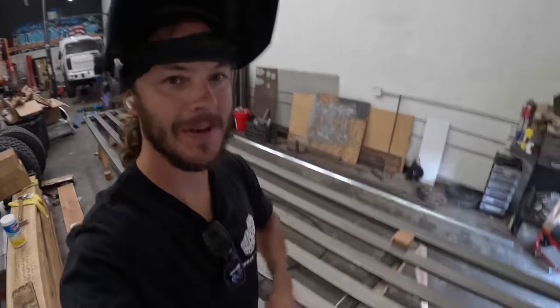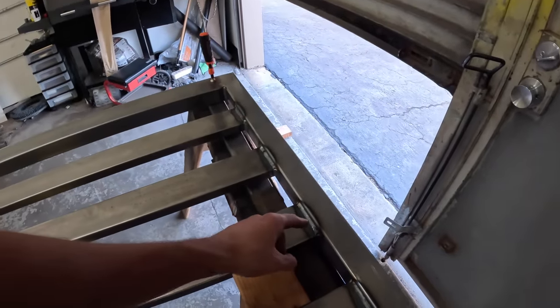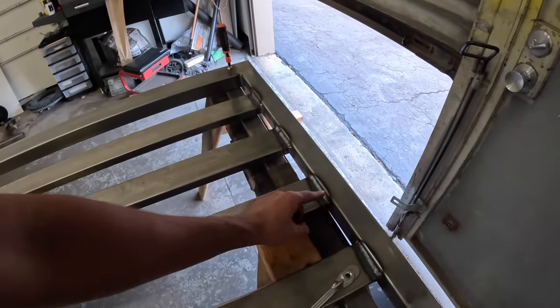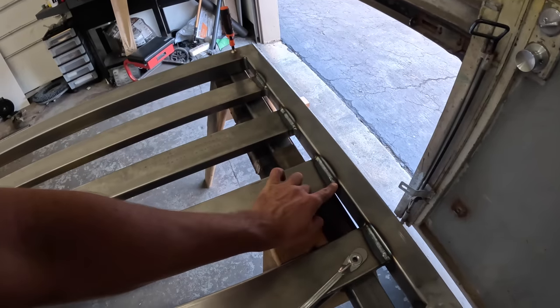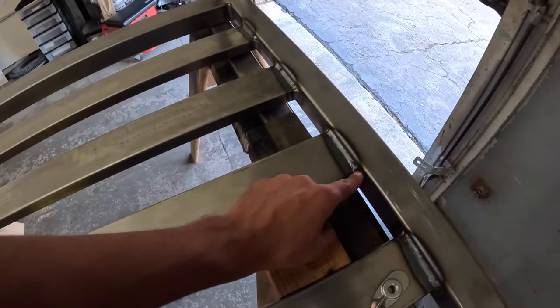Aside from flipping it over, we've got all of the horizontals in. The welds are decent — there are a couple little things I can work on. I wasn't really wrapping my corners as good as I should have on this pass, so when I came to do the sides it ends up not looking that great where that side kind of stacks over top. They're going to stick together — that's the most important thing about welding, and then second is you make it look good.